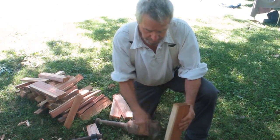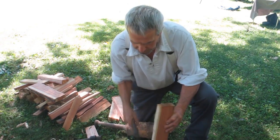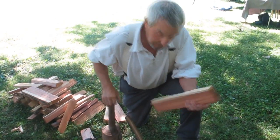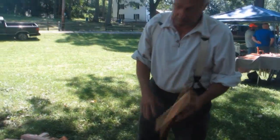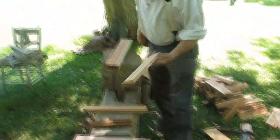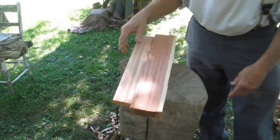Do you have any preference over the sapwood or the heartwood? Unless you're kind of getting down into the heartwood — for heartwood, but on cedar it will work either way. Any bucket has to be kept wet and functional. Now once I've split it down to this, I'm going to go to the shaving bench and the draw knife, and essentially work a piece like this to this stage right here, maybe a little wider — that to this with a draw knife.